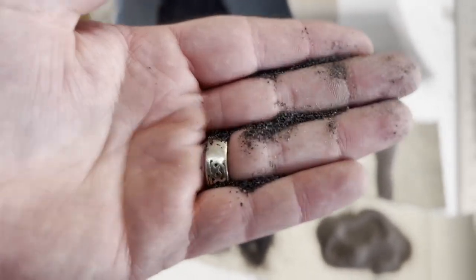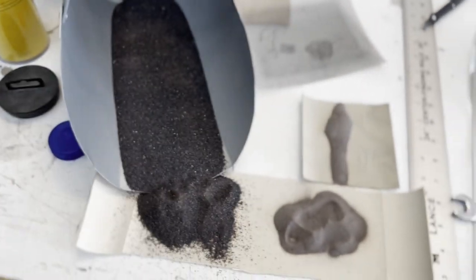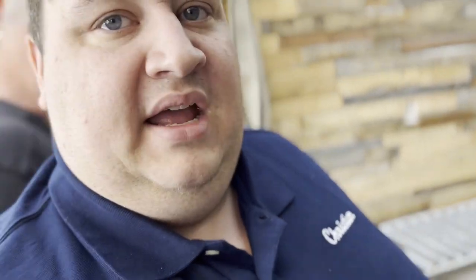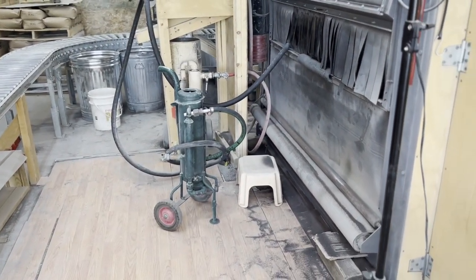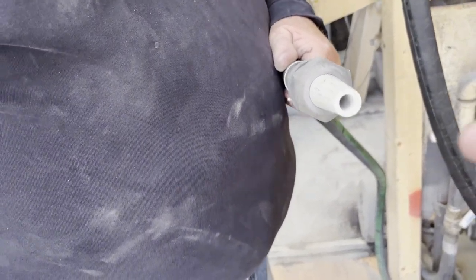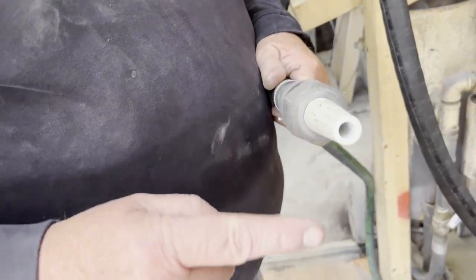There's the grit versus the powder. It does not take long to go over the stone. We go very quickly. You basically just want to hit it enough so that it's changing that surface of the stone a little bit. We use the green sandblaster to do all of our bluing. The nozzle that we use on there is fairly blown out, but you don't have to have an opening that big. It can be the smaller nozzle. We used to always use the same blaster for both. Now that we use the one we have set up for it, we can use whatever we want. A little bigger nozzle is kind of nice, but you don't have to have that.